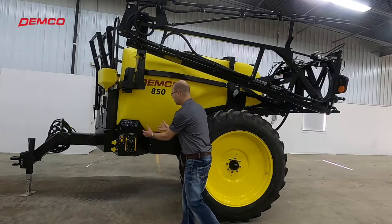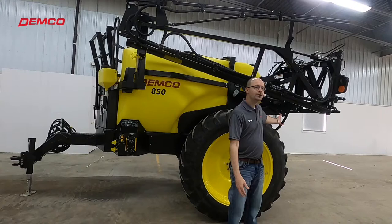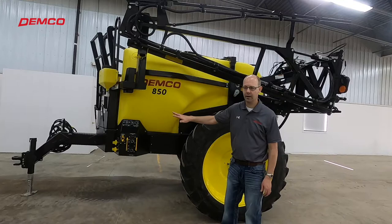Because the tank comes down into a deep sump, almost like a cone, it makes the tank easy to clean out thoroughly. Today we're spraying many products beyond just Roundup, so being able to clean out well is important. There's also a tank in the back to hold about 110 gallons of water for cleanout. Additionally, that deep sump holds the chemical in the bottom when you're near empty and operating on hills or uneven terrain, as opposed to a flat-bottomed tank.